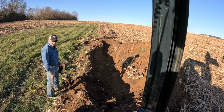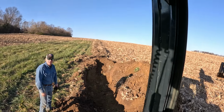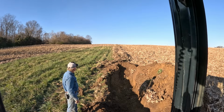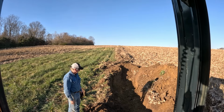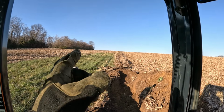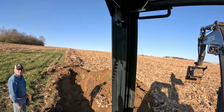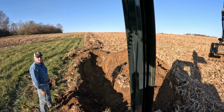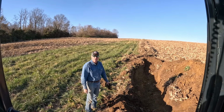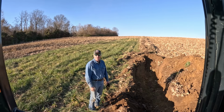The nice thing about that one was we never lost any elevation. We have so much elevation to gain. Yeah, I mean, if you guys are sitting here, look, like right here, the top of the line's way up there. So, I mean, there's eight feet more to the top of the line. So there's plenty of elevation here. And we're probably 6 foot above? There's probably 12 foot of fall. Yeah. The whole line. We probably didn't need to dig that up because we never ever lost elevation. You just want to be on the safe side and do a good job. Make sure it's okay. Make sure we didn't pinch or collapse the tile.